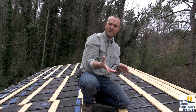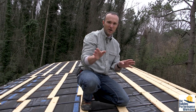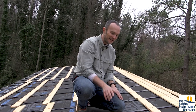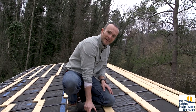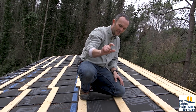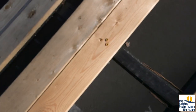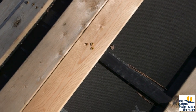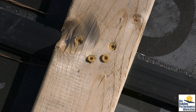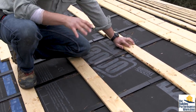Maybe you take a 6-inch strip of butyl tape and wrap it around the underside of it. All that is academic because I'm not doing that on this house. But if I was to run that 2x4, I've got more meat to be able to attach my metal roof to, and it wouldn't split as easily as these 1x4s do, which does happen. And also, as you can see right here, you do end up fishing for where the rafter is, because when you lay your strips down, they're not going to be perfectly straight.